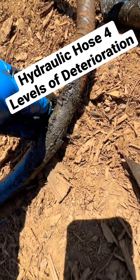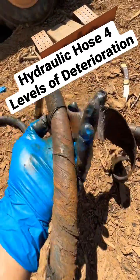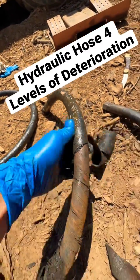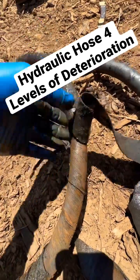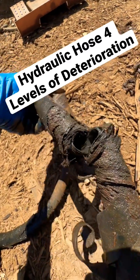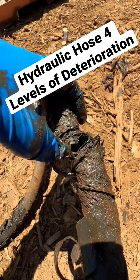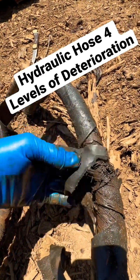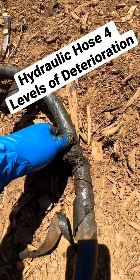You can see where this is worn through and exposed the steel cables. If you have fluid underneath and you have a bubble, this is the next layer — these cables. This hose will show you all the failure and all the layers. If you have fluid coming out of your membrane, through your steel belt, out to this outer wrapping, and you have fluid in here, your line is about to fail.